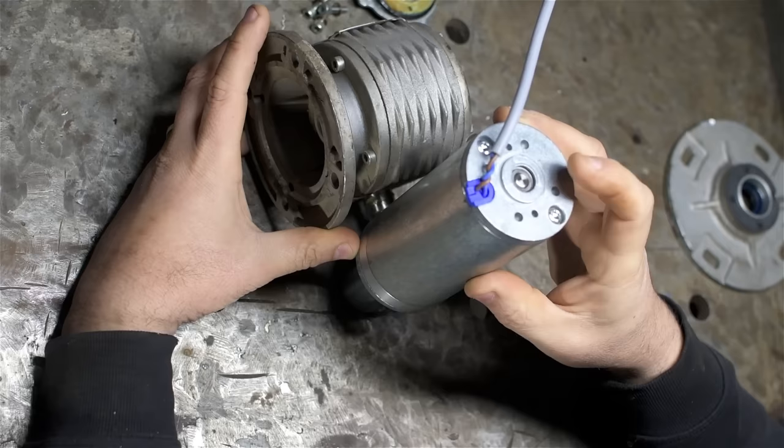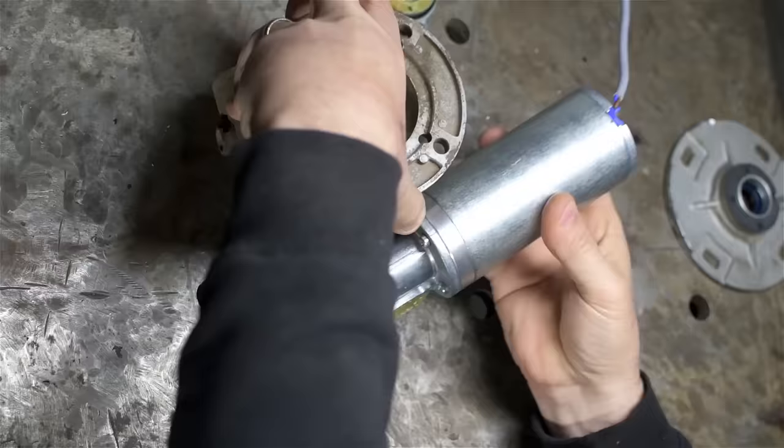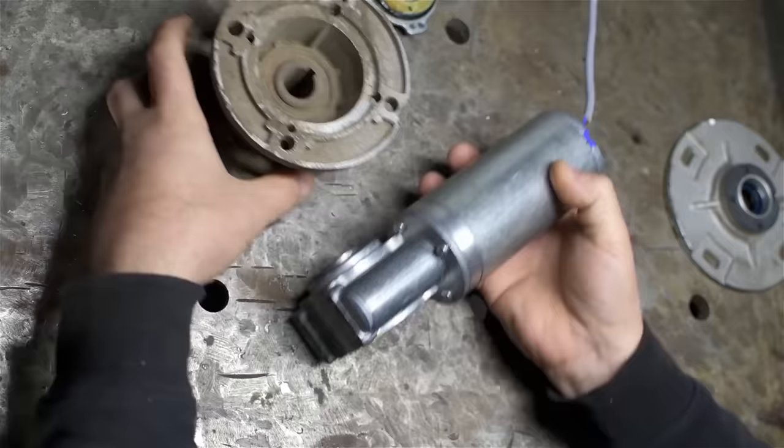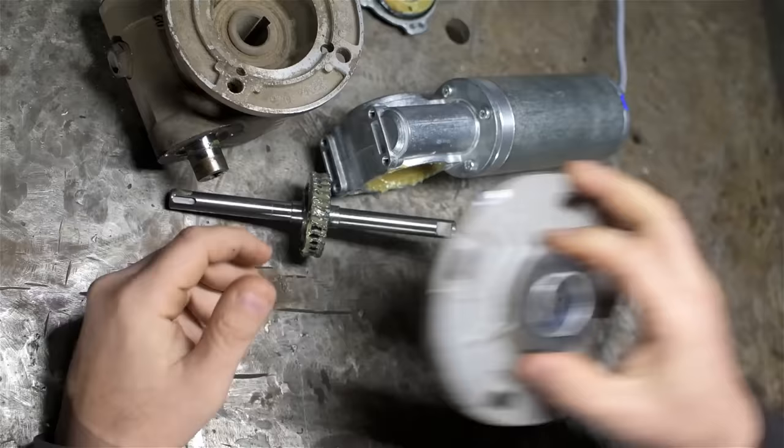And then slip all of this inside a large piece of structural steel tubing. I think if I keep the overall form factor square, I can then flip the box over in any direction on my bench, clamp it down, and maybe have a more versatile and easy to store turntable. In order to do that, I'm going to have to modify this shaft. It doesn't currently fit. And modify the gearbox flange, attaching the DC motor directly to this and then screwing this back onto its gear drive.